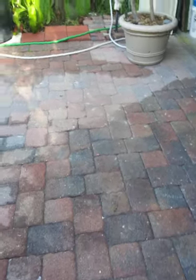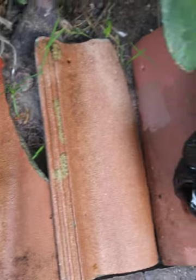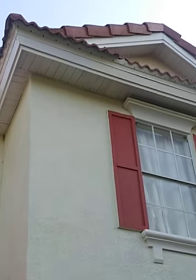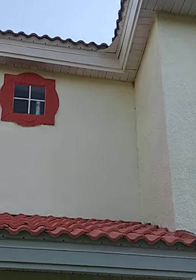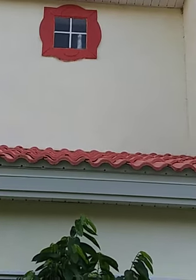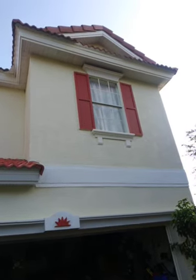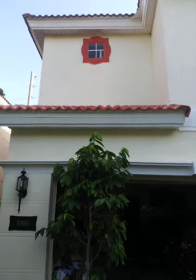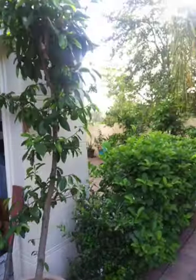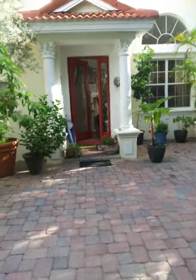I did paint the tiles — they get quite moldy and mine are pure terracotta. A couple actually fell off, so make sure your ladder isn't pushed up against a tile that's going to move. Don't forget to check your local weather — right now in the morning I can paint this side of the house. I was getting too much sun and burning up, so it's better to do shaded areas while the sun is not on them, then do the other side in the evening when it's shaded.